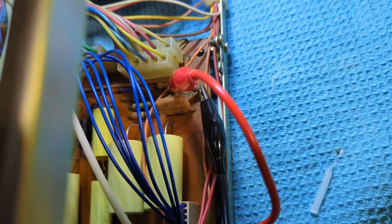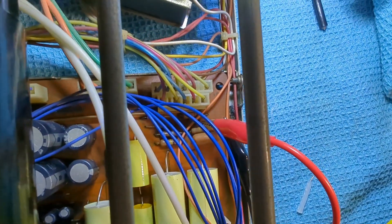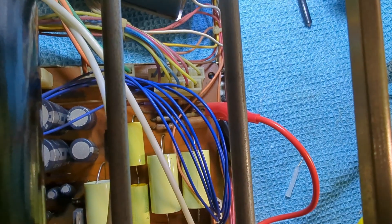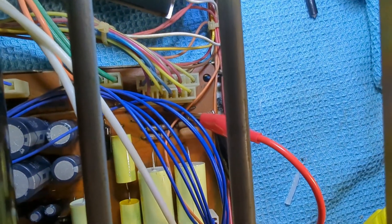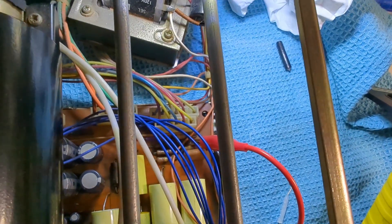I did have a look at the one next to it as well - resistor 191, I think it was - and that one was fine. You can usually probe across resistors in-circuit as well. Everything else around this part of the circuit seems to be okay. But that one megaohm resistor - resistor 175 - has to go and be replaced.